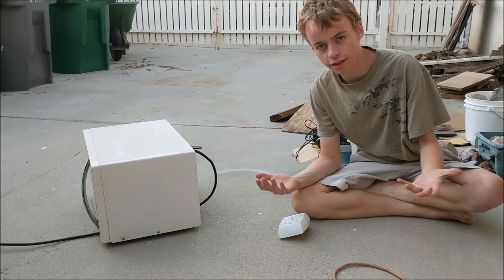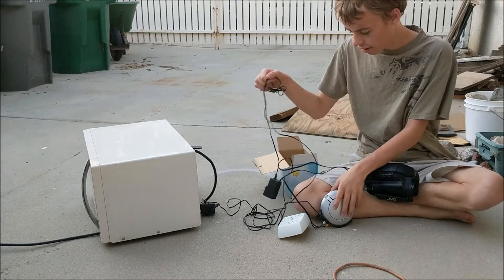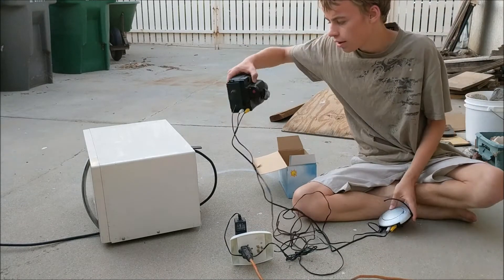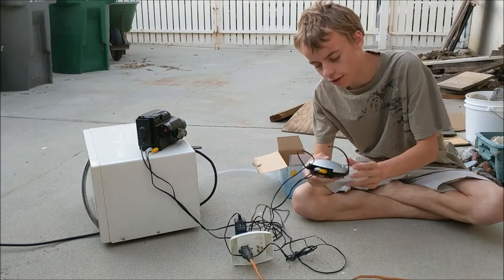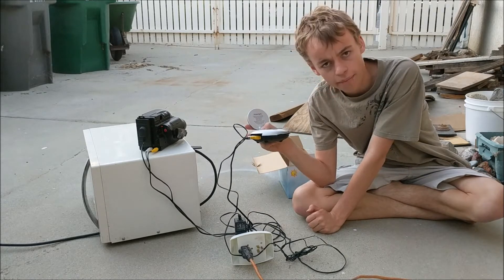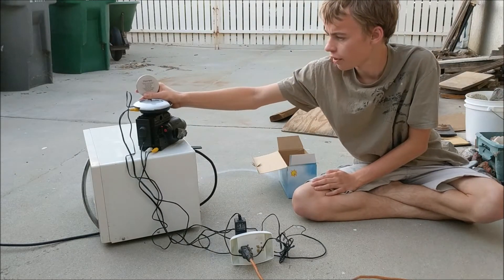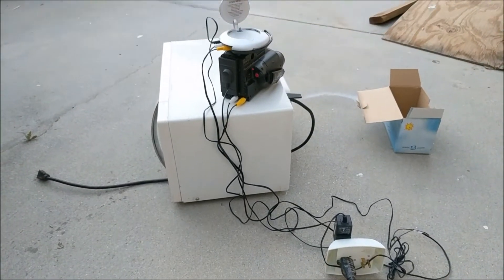Now it's time to set up the transmitter section of the CCTV system. We're going to take our box full of all the parts, hook them up to this little power plate, hook it up to this extension cord, and hopefully we'll see some results. The transmitter is running — looks like we're in business. I'll set this camera on this microwave, just pointing at the gate so we can see if any intruders come in. I'll take this transmitter, set it on top of the camera, and aim this little satellite dish looking thing on top towards my bedroom, where I have my receiver. This is a unidirectional antenna and it will aim the radio signals that way. This is, for sure, a super ghetto CCTV setup.